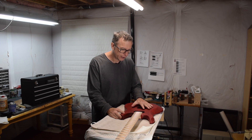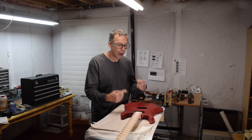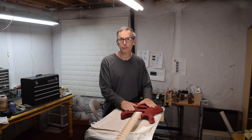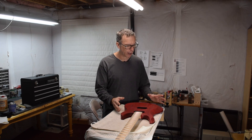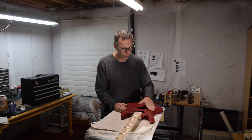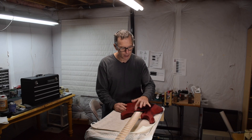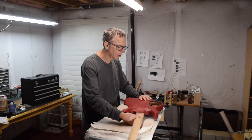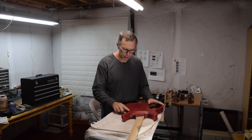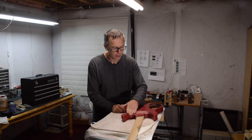In this particular instance, when I began building this guitar, I made a simple mistake. When I make a guitar body, I use my CNC machine with several files to carve the whole body out. I have one file for the front carve, which includes the contoured edge and the pockets, and then I have another file for the back, which includes the belly relief, the control cavity, and the scallop in the front where the neck meets the heel.